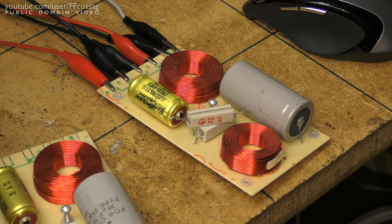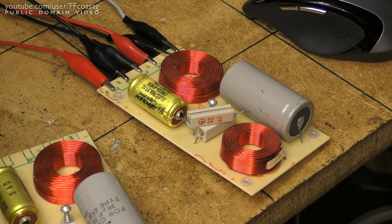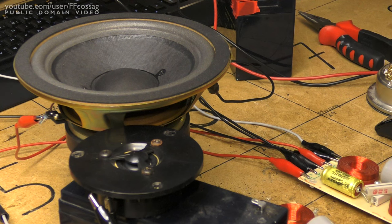I did some experimenting — put a 10 ohm series resistor with the tweeter; it put it just a bit too low. But then I just replaced the original 2.7 ohm series tweeter resistor with the same 10 ohm resistor. And now let's just have it speak for itself — have a listen to the new modified crossover. I think we can go with that!